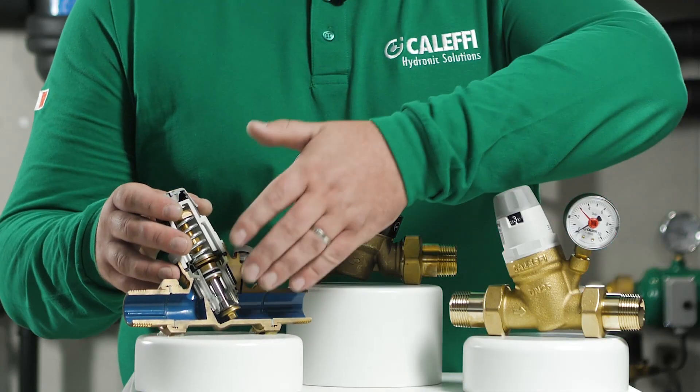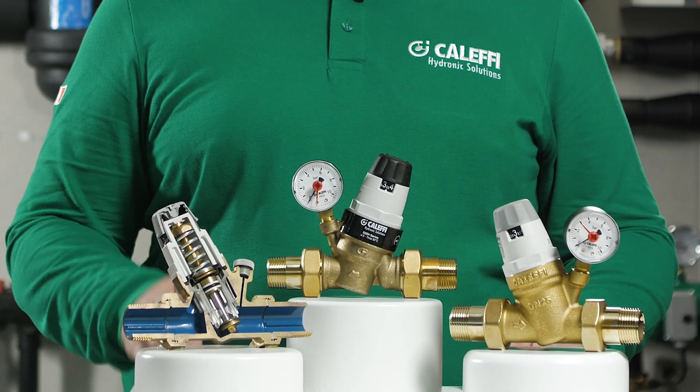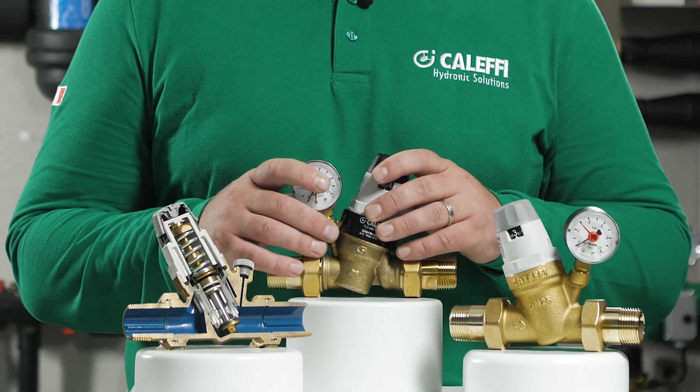There are a number of potential causes for failure resulting in downstream pressure increase, and these are dirt on the seat, a high increase in upstream pressure damaging the diaphragm, or disengagement of the control function.